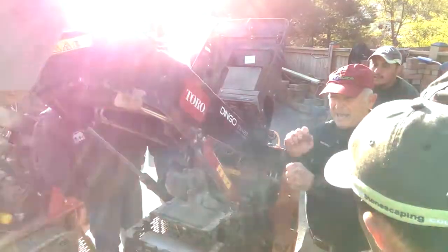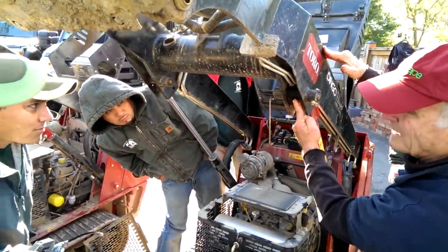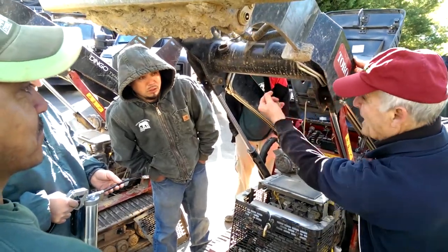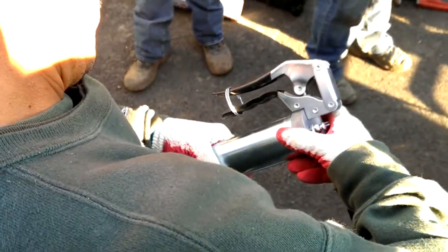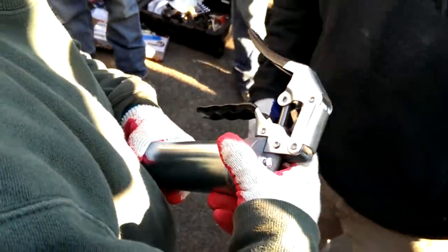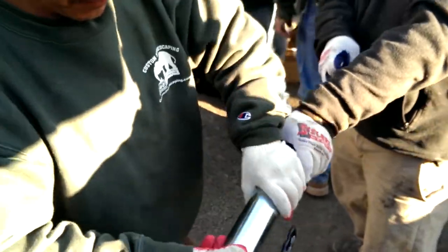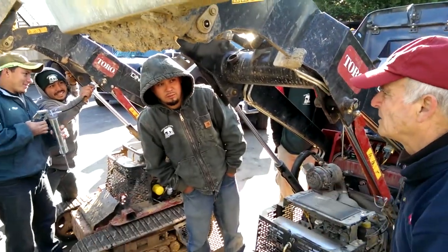It's really wherever it bends or twists, like here. That's a grease fitting. There's one right here. Sometimes, if it's been in the dirt, you'll have to clean it like you guys did. Whenever you go to grease it, take this off. If you look on the inside, you'll see the grease come out, and that's good. That's all you want to do.